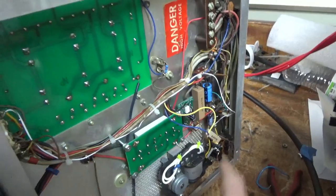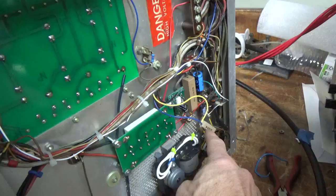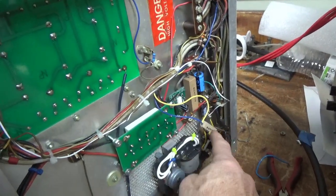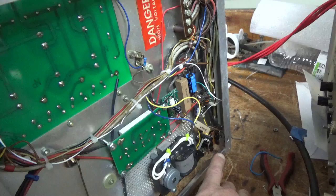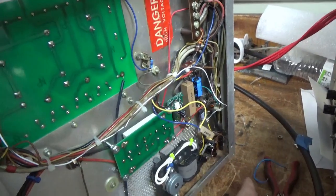The customer put in this new TR relay and it had the wrong resistor in. That's the proper one now, proper value. The coil is part of the bias circuit, so the coil resistance has to be correct.